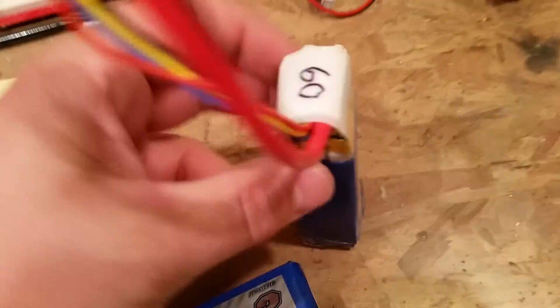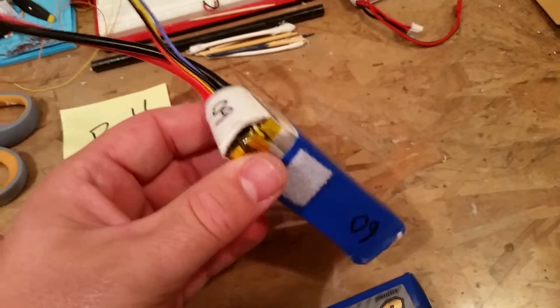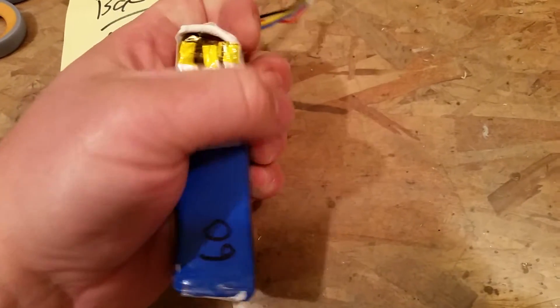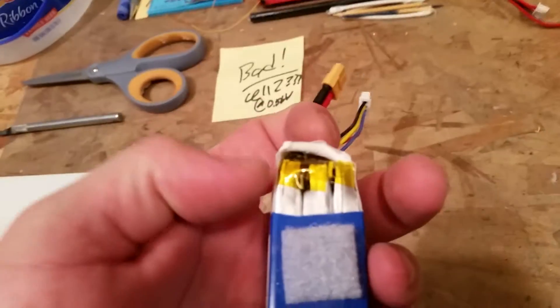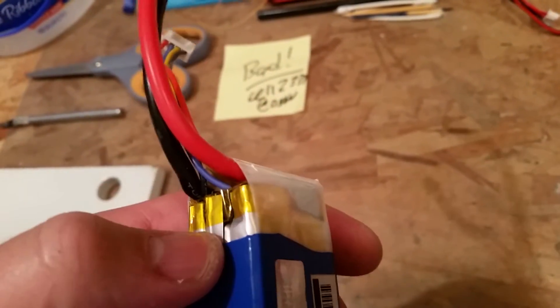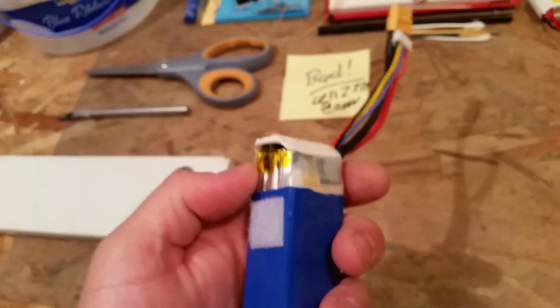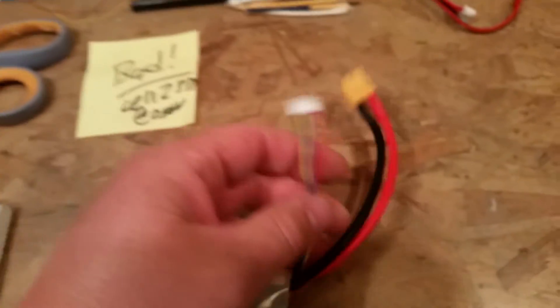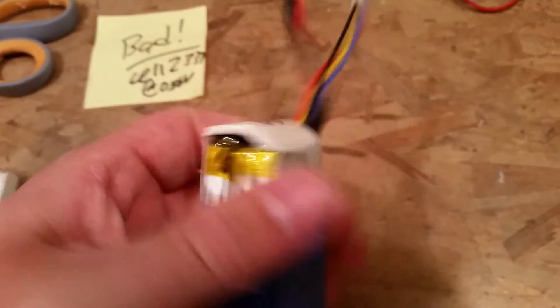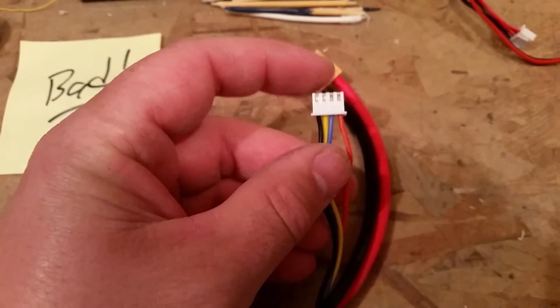These are kind of expensive so I'm not just throwing it away. I've taken a number of different 3S cells and turned them into 2S cells. When I get this peeled back, there's a piece of squishy foam that gives a little protection to those endpoints on the lithium packs. We're going to get to that and see what's wrong with cell number two - the blue one. You can actually take a voltmeter and go ground to the terminal to check the voltage on each cell individually.